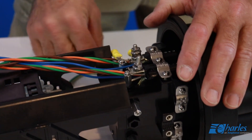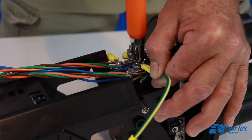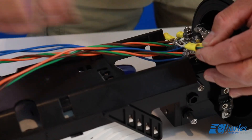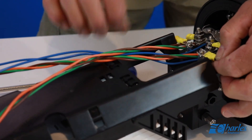Repeat this procedure on the second cable loop opening as well as for any armored branch cables. Following the deployment of the splice case, attach a ground strap or wire to the external bonding screw.